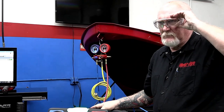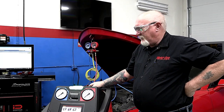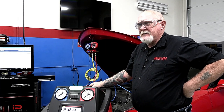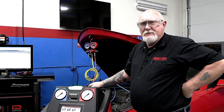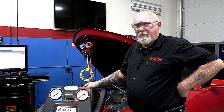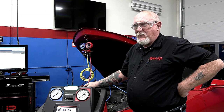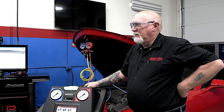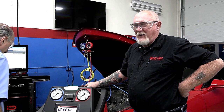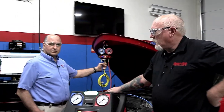That primary seal concept also applies to tire caps. The caps on the valve stems are a primary seal — make sure those are there to keep the valve from opening a little bit. I've had more than one blowout on an RV trailer because of that. So let's take a look at what our requirements are.